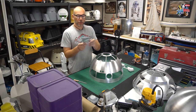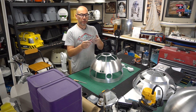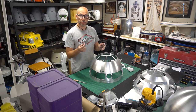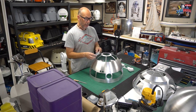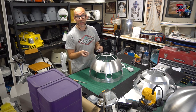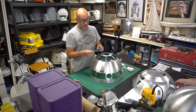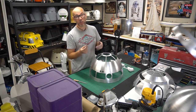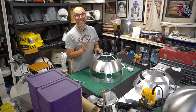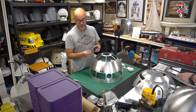So a few pointers for preparing your panels to get them ready for painting and finishing, ready to go back onto the dome. As we discussed earlier on, I recommend silicone, it's very good. You can use clear, so if there is any overlay, then you don't see it as easily. And once it's dry, you can just trim it with a knife. Alternatively, what someone did say to me, and it's quite a good idea, is you could go for white silicone. So then when it does bleed through the gaps, it's easier to see, and then you have to remove it all, obviously, and it's easier to find.